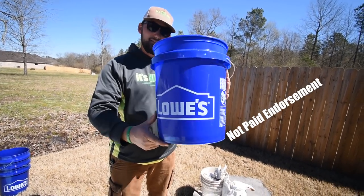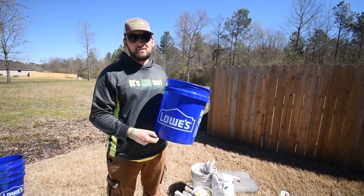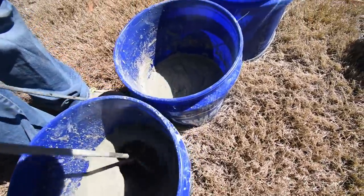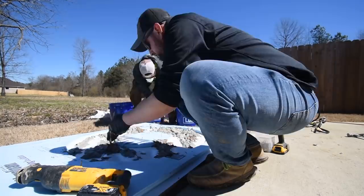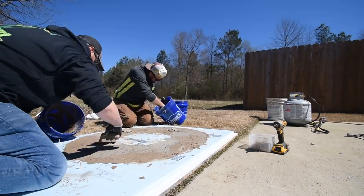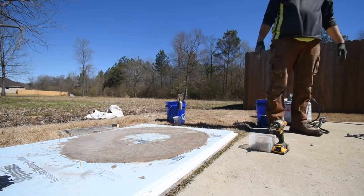This part of today's video is brought to you by Lowe's. We have our Lowe's buckets — we forgot our other buckets, got more Lowe's buckets, and yes we had to pay for these because they don't do a bucket exchange. We're going to fill this up with water, about six quarts in each bucket, and do about half to three-quarters of a bag per bucket. We're doing three colors: natural, a little bit of white to get a silver color, and a little bit of brown to give it almost like a natural fawn or sand. This is a similar process to the countertops we did a few days ago. We're going to get this stuff wet, lay it in, trowel the top out, and stamp it to look like the patio.